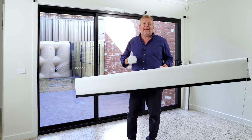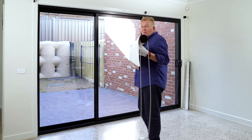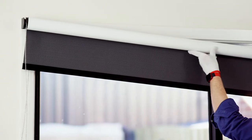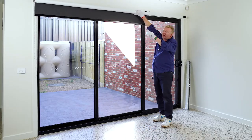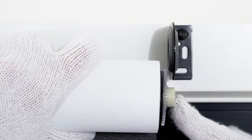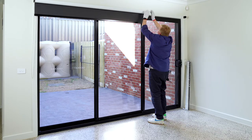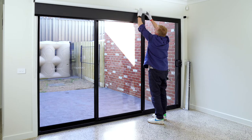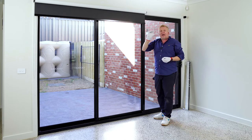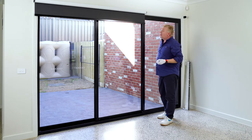When installing a linked layout number one, we always have to do the left-hand blind first. Let's make sure that our chain is hanging equal on both sides and our little cover is at the top, and we can go ahead and fit this blind into the male bracket — just like that. I'm holding a little bit of pressure towards the left-hand side, because I have to click this section into the bearing bracket. The way I do that is I just push my finger in on the end of the cap and then slide that in — you can feel that's clipped into place really well. What I'm looking for is about one millimetre of float from left to right. I've deliberately not installed the bottom screw so I can shuffle the bearing bracket a little bit left and right a couple of millimetres if I don't have that float. But in this case, I do, so let's go ahead and fit this second screw.